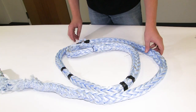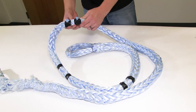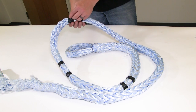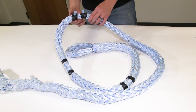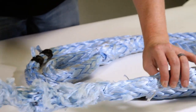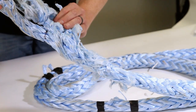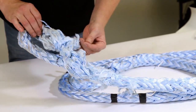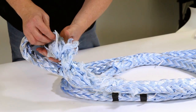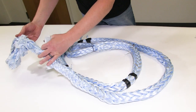Continuing down, we have an example of a full cut — one strand completely severed. This one is definitely completely out of service. And then if you look in the eye where the actual break happened, you can see examples of yarns and strands being completely severed, examples of what fuzziness might look like in some of these applications, and where the overload occurred.